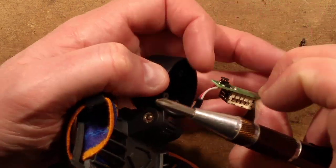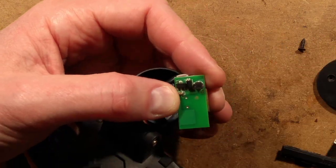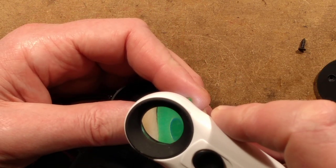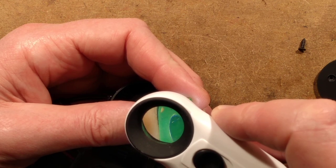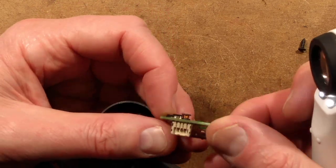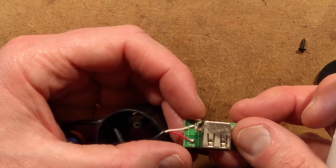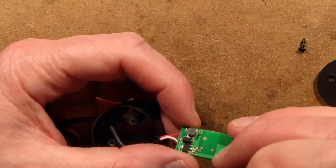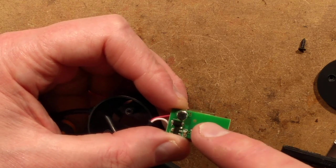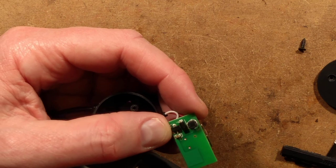What we have here is a very odd little thing. We've got a little more transistor-type package called B3P6C. We've got a diode, a capacitor across - probably across the output. And we've got a diode which is probably part of the boost circuit, along with a 100 microhenry inductor - or is that 10 microhenry? It's marked 1-0-0 and I've not actually got anything to measure that with.